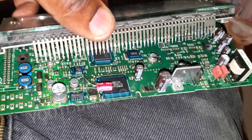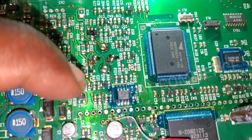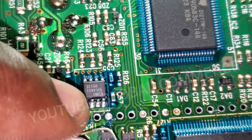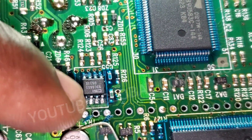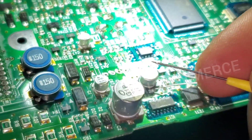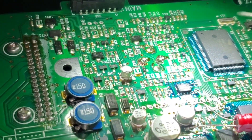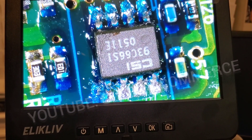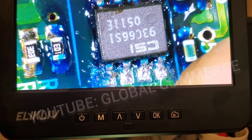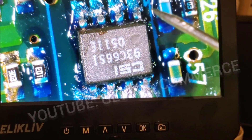Once it's desoldered, the display lifts up and you can see all the pins that were soldered onto the board. Our EPROM chip is located right here — it's a 93C66. There's basically a gel protecting the pins of all the chips here, so you just have to scrape it off. Under the microscope you can see the size of the chip and the gel consistency — it's like a gel. Once you scrape it off you can get to the actual pins to connect up.